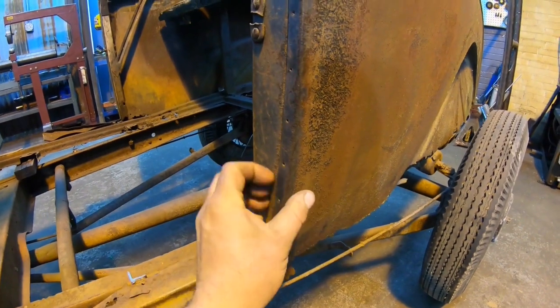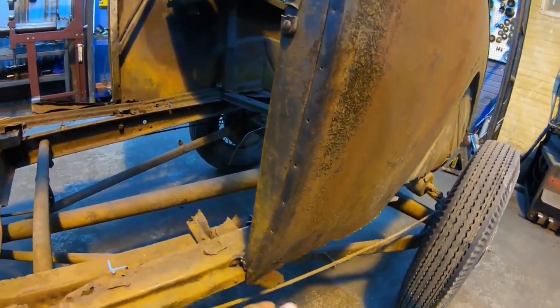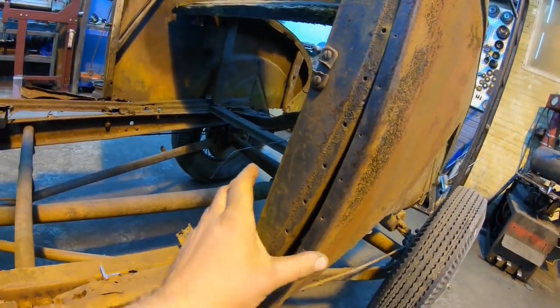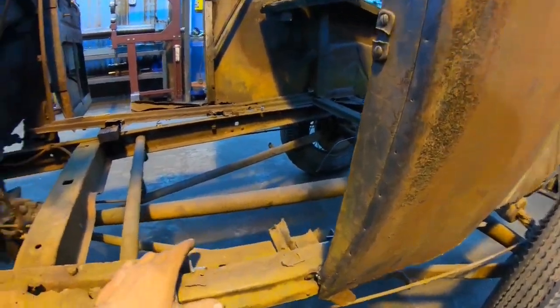Over here on the side too, you can see that the nails are all gone out of our quarter panel. We'll pop this off, drill these holes a little bigger here, clean up inside the jam, push this together. Let's get those all plug welded too, and basically start tying this thing together.